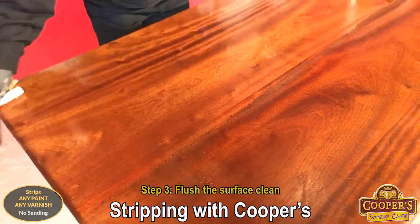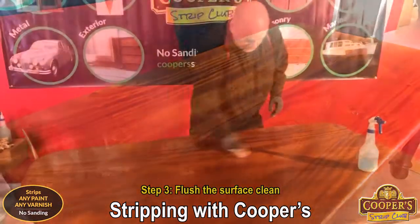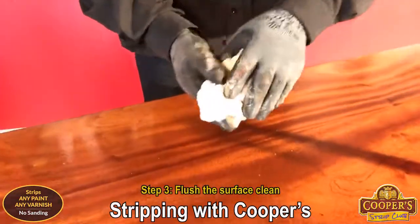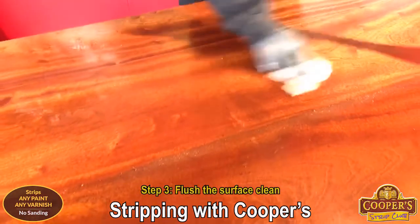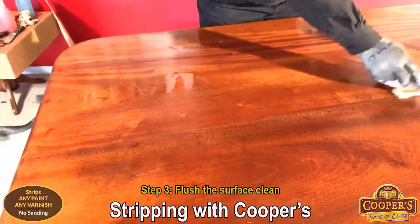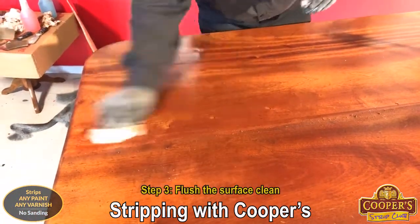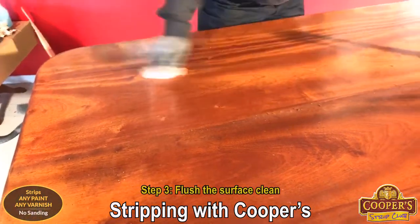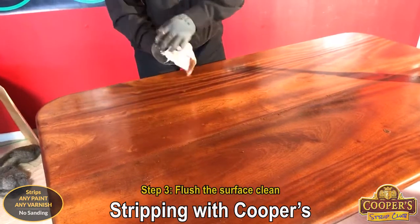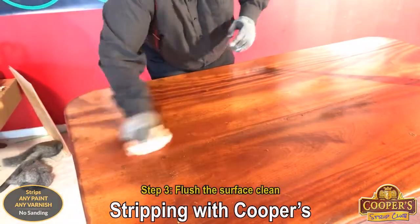So on the guide it says spray scrub, spray wipe. As I'm wiping, I'll be turning the rag around onto clean surfaces — that picks up all the goo and gets all that residue onto the rag rather than soaking deep into the grain where it could cause upsets for a new finish. So this rinsing phase, this flushing phase is very important. It is the no-sanding part of the game.